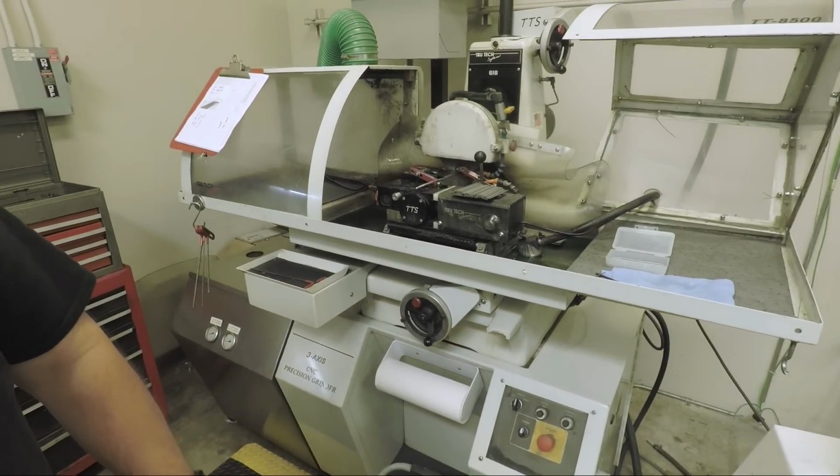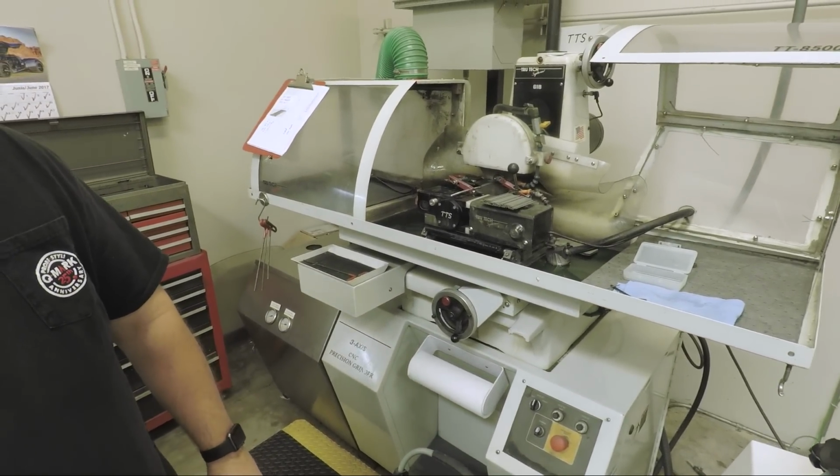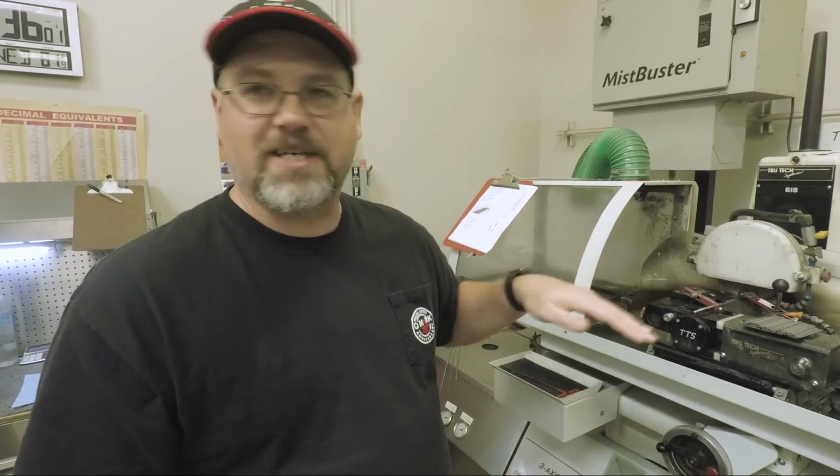And that's a diamond wheel, so it doesn't need dressing. Well, we actually dress quite frequently. Really? The issue we have is we need a very square corner for that ruby to sit. Our maximum allowable radius is less than 5 thousandths. On the shoulder. So we're constantly dressing that wheel to keep that to a minimum.